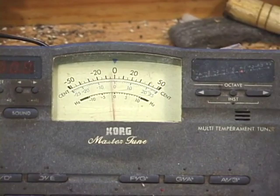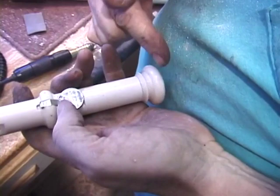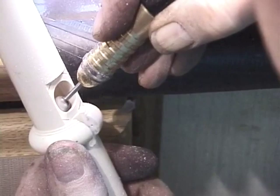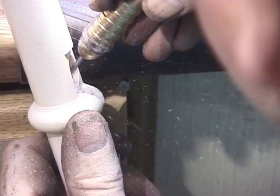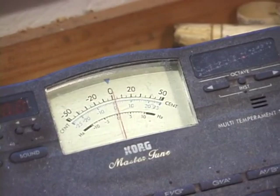Now working on this huge tone hole that covers the C key covers. Gently working that with a ball-ended burr here. Again, it can be worked perfectly well with scrapers, files. This is just another technique for you to study. Of course, you can do great damage using these techniques, and so you have to be very, very confident with your hand tools if they are power driven.